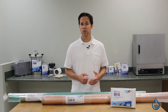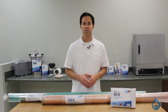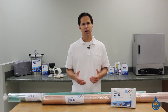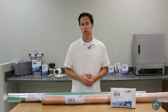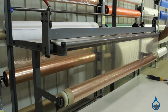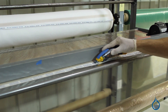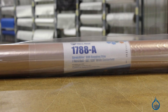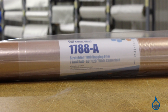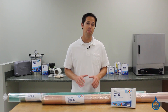This results in improved physical properties for your part. The target fiber-to-resin ratio for most parts is about 50-50. This is nearly impossible to achieve with a hand layup, so fabricators choose vacuum bagging to get closer to this ideal resin content. A critical step in this process is choosing the right vacuum bagging materials, which stand between the vacuum source and your composite, and are usually disposed of once the process is complete. Let's take a closer look at each of the categories, beginning with vacuum bagging film.